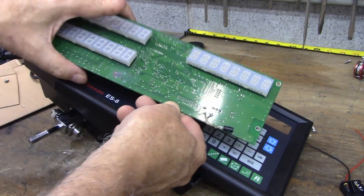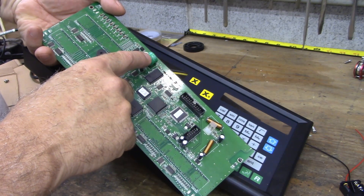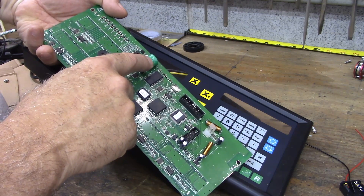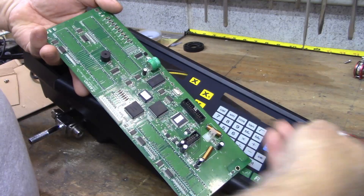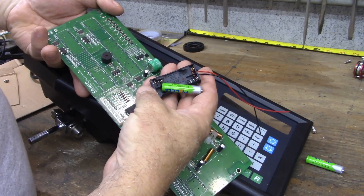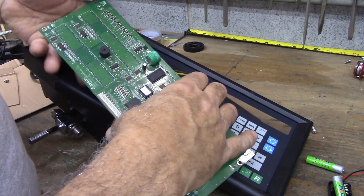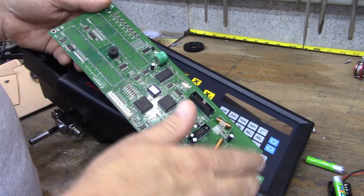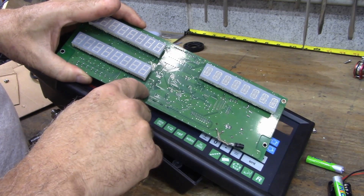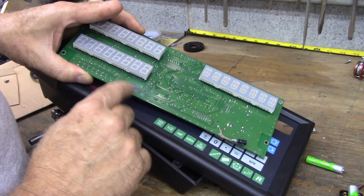The other thing I'm doing is getting rid of this battery. I probably bought this less than 10 years ago but pretty close to that — I don't want this to happen again. I've got a little battery pack that I'm going to use to replace it. I'm going to put it on the outside so that if it leaks again, it's not ruining my circuit board. I'll need to take this off and solder some leads here and here to reconnect the battery pack to this board.